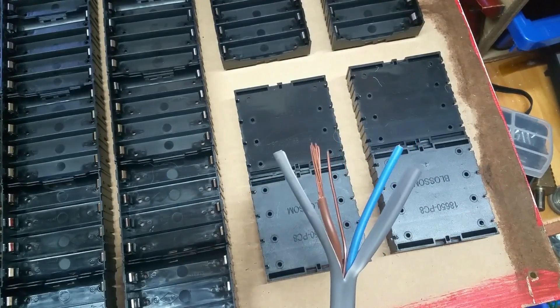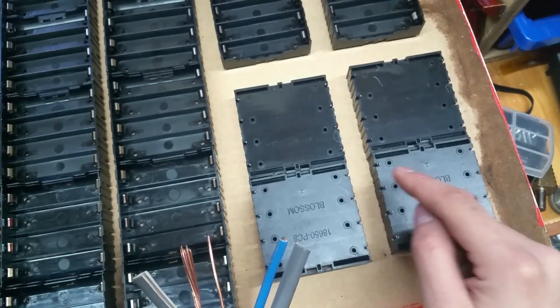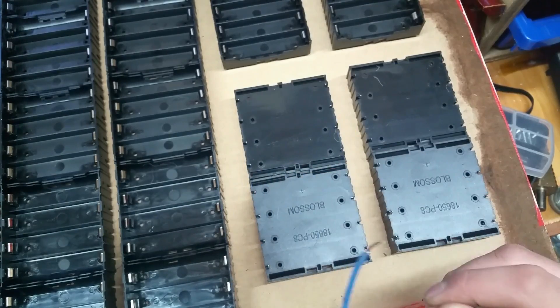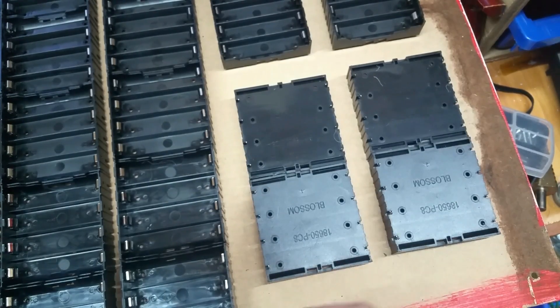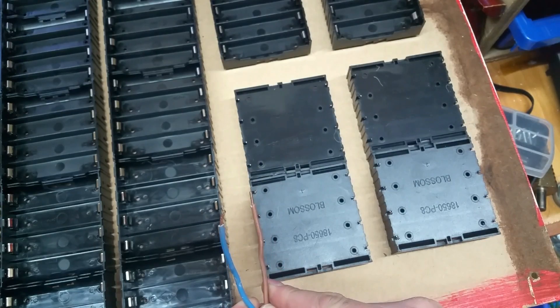The next one will have a positive bus bar — just bare copper, no color coding. We'll solder links across to it, probably using 2.5mm twin-and-earth, which is a bit smaller, and solder a link across on the negative side. On the positive side we'll attempt our first fuse — joining the four positive ends with 2.5mm or maybe 4mm wire; 4mm might be better. It'll be fiddly to solder but might be worth a try, or we can just keep individual fuses for each cell.